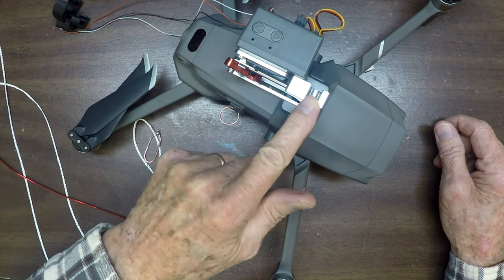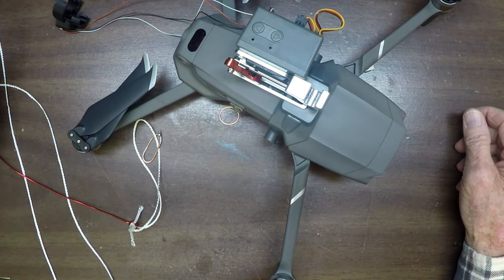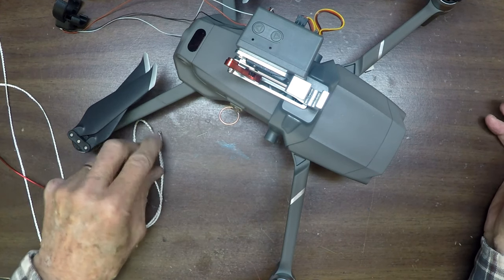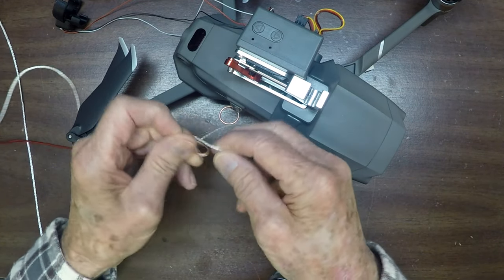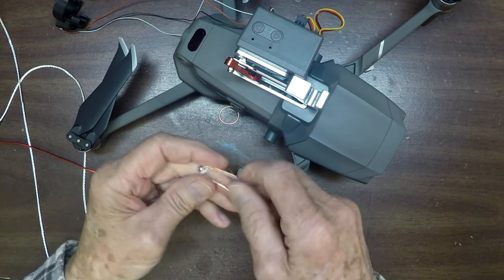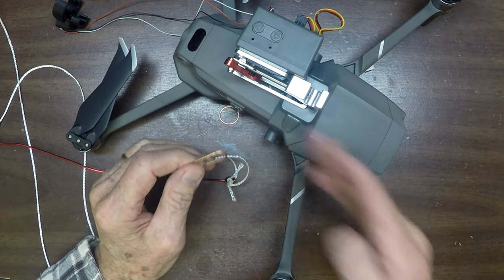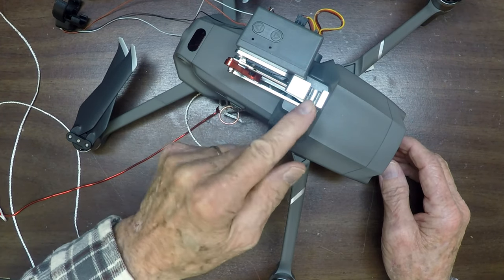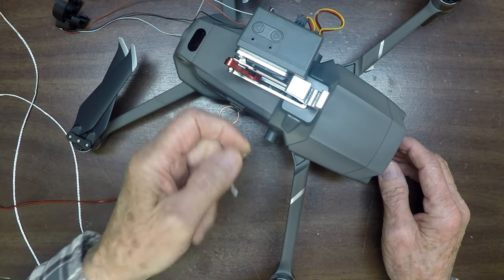The final conclusion: you have to have metal around this thing instead of string, because metal doesn't have any binding effect and just pops right off. The string had enough binding effect that the servo was too weak to pull itself back. Metal has no binding effect, so the servo is free to retract. The servo is too weak for any real weight, so you need to use a metal clip.